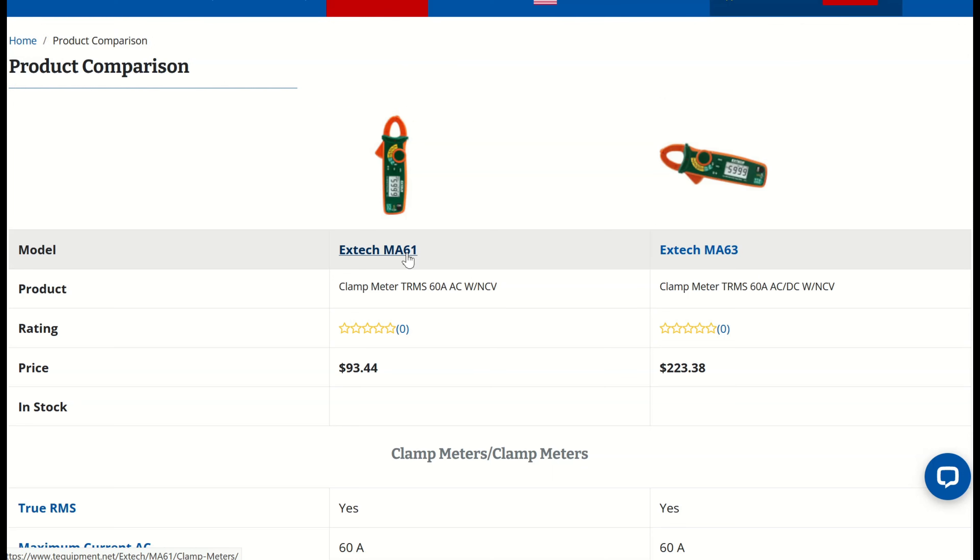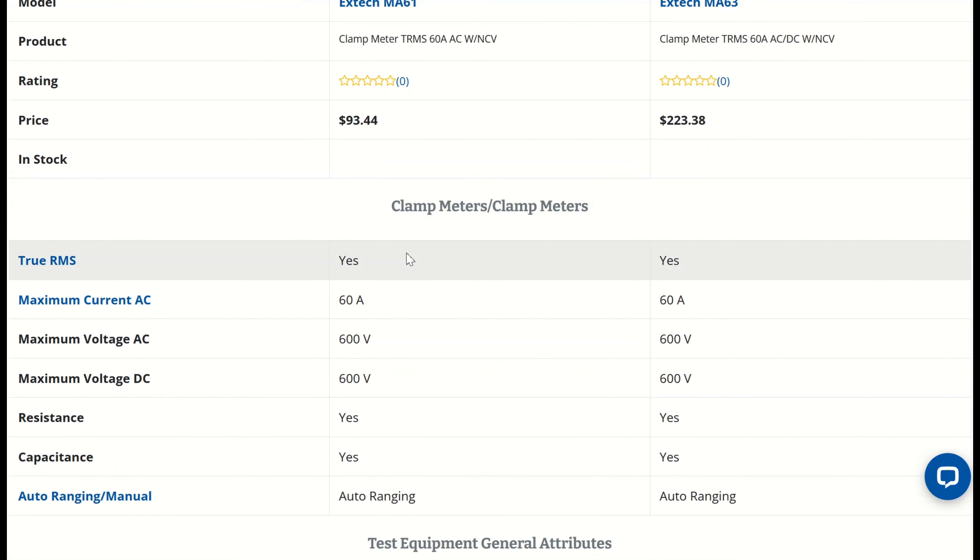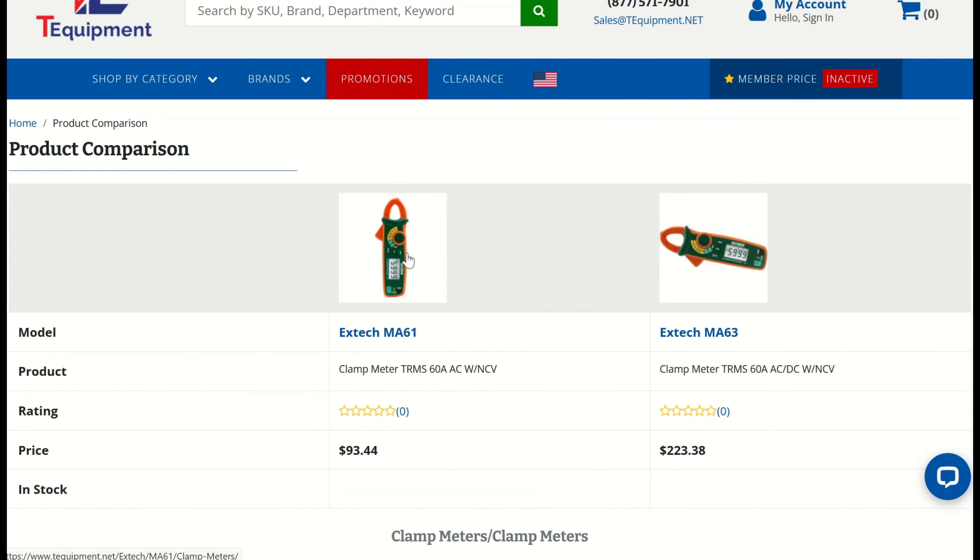You could probably get away with buying the cheaper one and modifying the EEPROM chip to add the DC measurement range. We don't know if it uses the same EEPROM chip since it's a 6,000 count meter, but they apparently fixed the bug where measuring more than two amps and zeroing the meter would cause it to go into overload and not show results anymore.